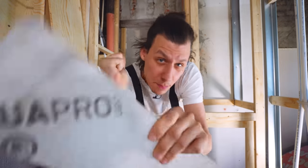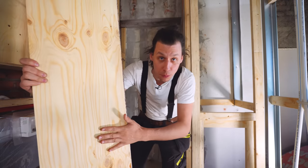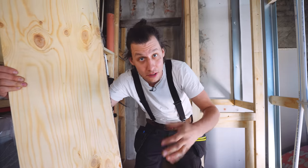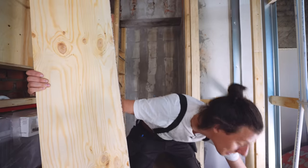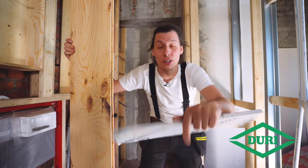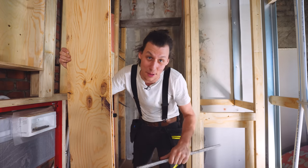The end goal of this video is to have a fully watertight bathroom, and what's going to make that happen is this waterproofing membrane board — a cement board with a waterproofing layer glued onto it that we'll screw onto all the walls. But first we need to attach plywood boards to the walls for two reasons: it gives us something to screw into for hanging cabinets later, and a solid base for the waterproofing boards. Both the plywood, which comes in tongue-and-groove strips, and the waterproofing boards are provided by Dure, a local hardware company in Oslo.